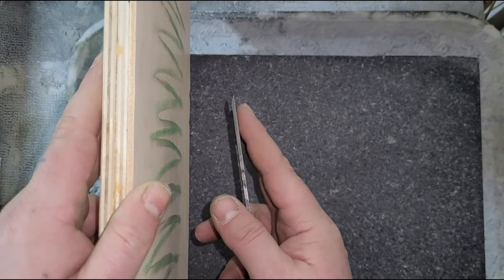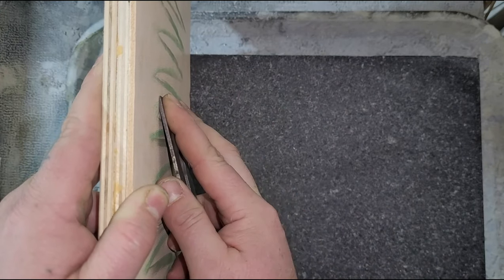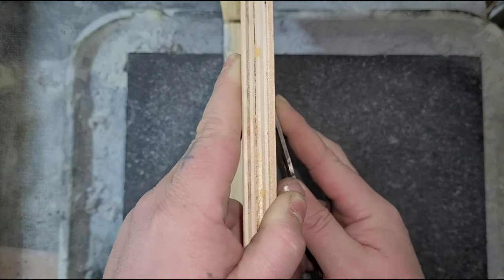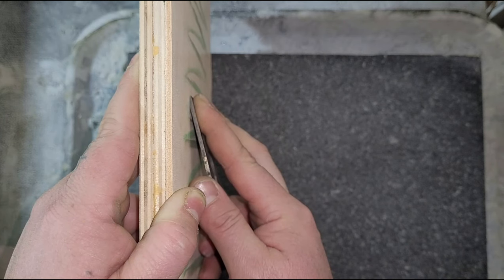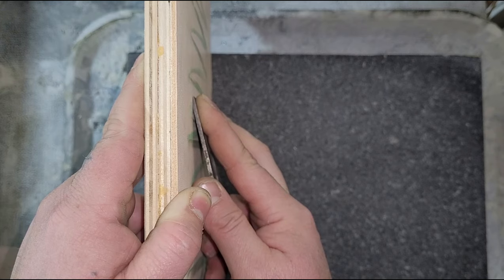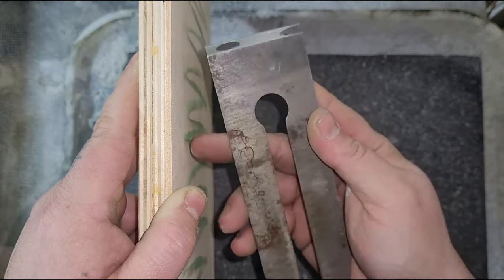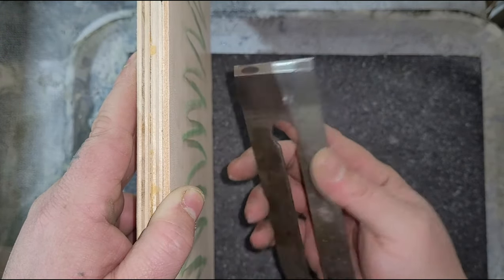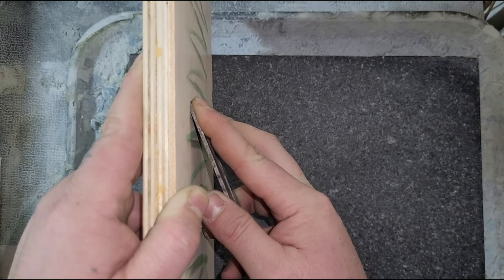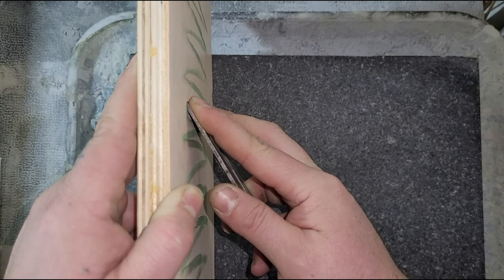So when you have your strop, this is the same thing that you do on a stone. So you want to set it down, find your primary, slightly up. Okay, let me scoot it over here maybe. Okay, so you set it down, find your primary, slightly up. I'll do it again. Set it down, find your primary, slightly up. If you can't find a primary because sometimes you have so many bevels on an iron, maybe you're too lazy to regrind it, whatever, that's okay. Set it down. Find what's close enough to a primary, slightly up. If it keeps going and you end up right here, that's fine.